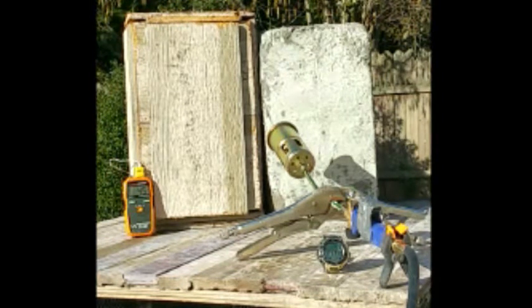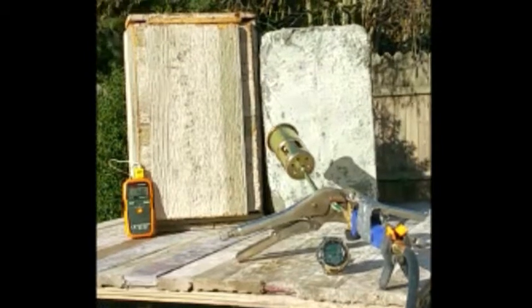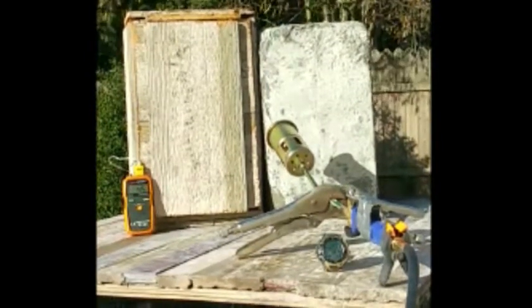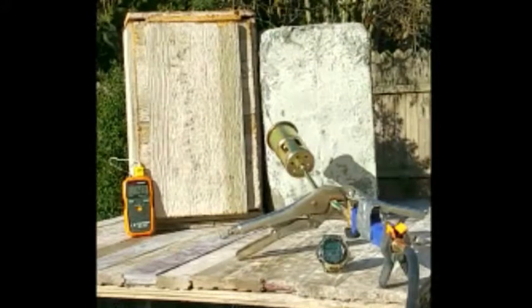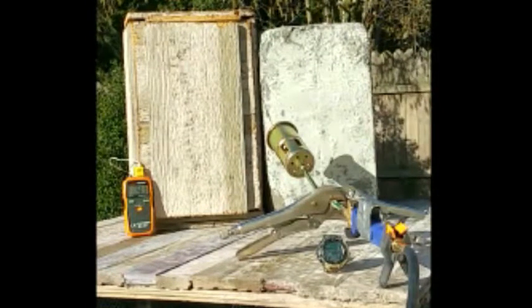What we have here today is a burn test. You'll see before you a block of the composite material that we've been testing on the right, and on the left is a box of a comparable size made of material that usually is used in the construction of most houses. You've got LP siding stapled to about a half inch of OSB board. Behind that, I've got 5 inches of insulation, and in the very core, sheetrock.